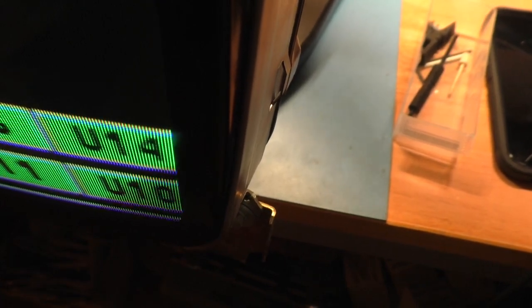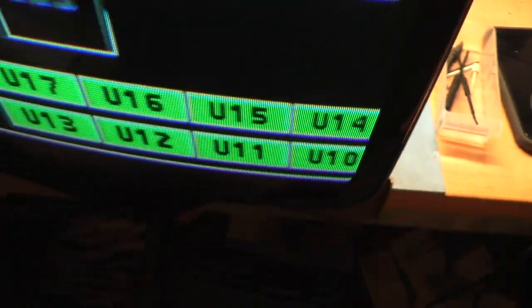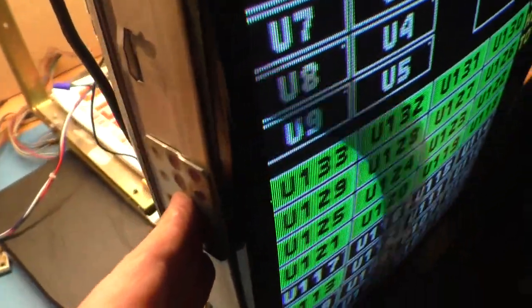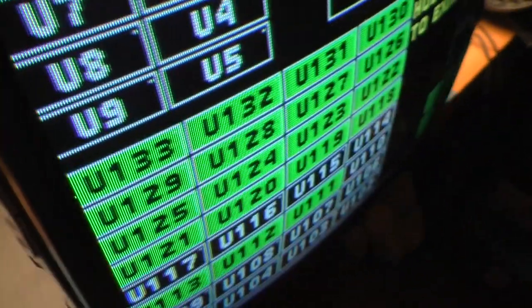Okay, so yeah, down shrinks it, but it only gets to a certain point and then stops. And as I go back down, it gets wider again. So we either have the wrong width coil installed or we need to change out our... I put the factory 0.394 C38 in there, so we may have to change that out.